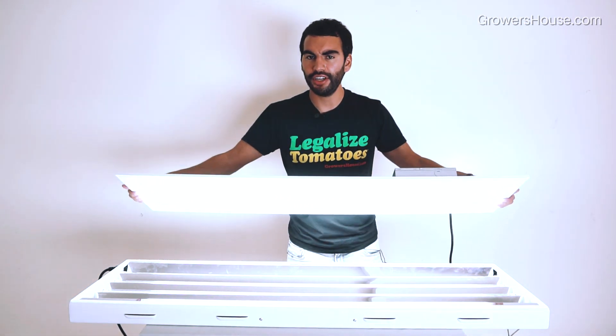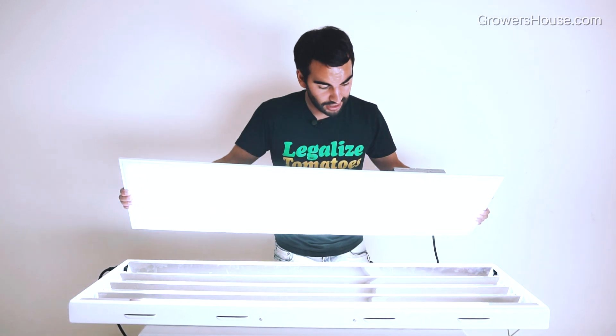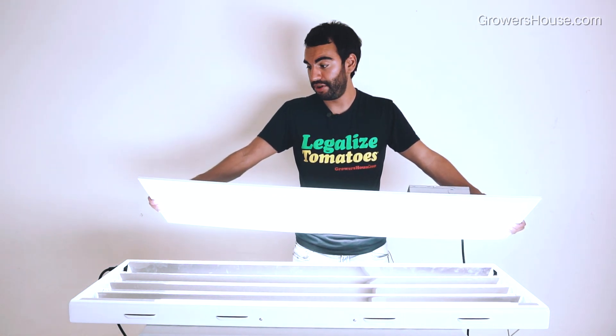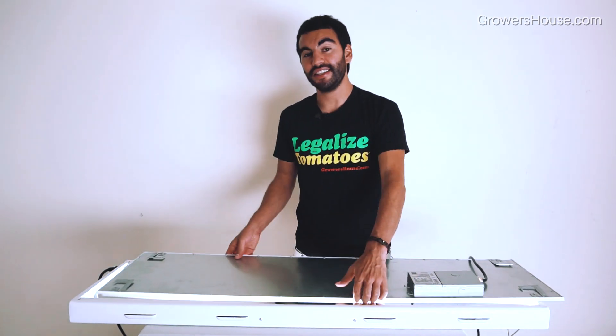These fixtures range about $130 on our site. They make a one-by-four foot at 40 watts, a two-by-two foot at 40 watts, and a two-by-four foot at 68 watts — different setups depending on how large an area you want to illuminate. Traditional T5 fixtures used to go for about $100, so for a roughly 20-30 percent markup you go from 216 watts down to 40 watts for propagation — a huge electricity savings. These are the new LEDs taking the growing industry by storm, helping people save money, illuminate plants better, and maximize their grow environment. That's it for today — this is Nate with Growers House, happy growing.